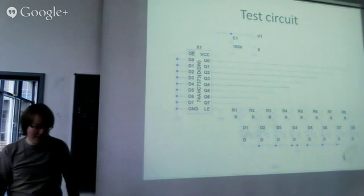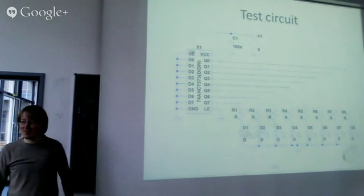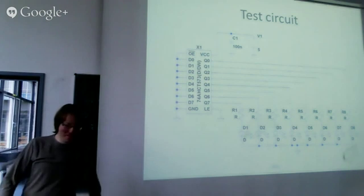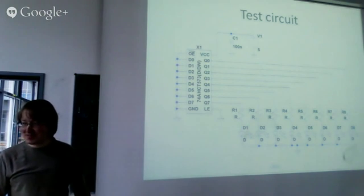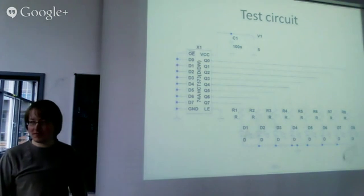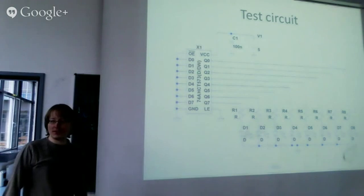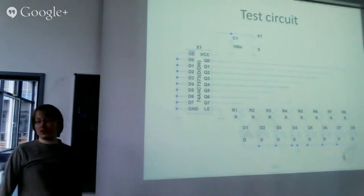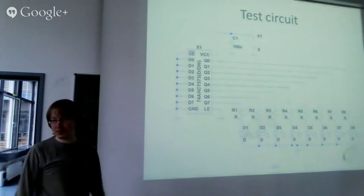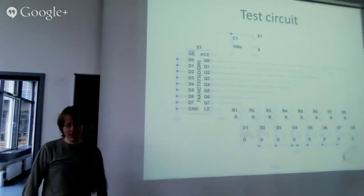That would be possible, but it would be better to find out why the Raspberry is not affected. "Oh, you want the Raspberry to be affected too?" "Yeah, I guess they have the same things. They will have some countermeasures with lots of inductivities, but not capacities in that case, I would say. That's for keeping it from oscillating at low frequency." But there are no inductivities on the Raspberry Pi. The circuit is published, and there are no inductivities to ground between the connectors. They're just directly connected.